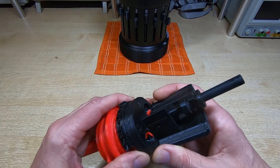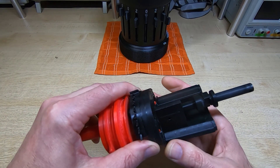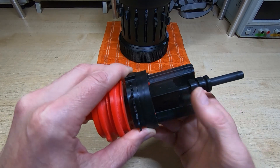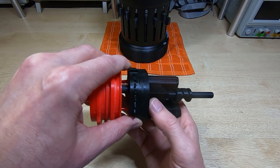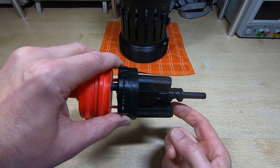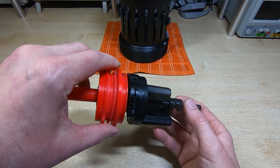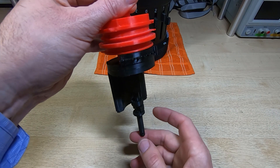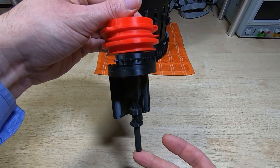The whole sides are kind of tapered so it allows this to slide in. The idea of the spring is it's supposed to positively locate the step drum in one of two locations - a bit like the carry lever springs are supposed to put the carry levers into one of two locations. You have the position where the step drum is lowered - that's the addition mode - and then you have the subtraction mode where we raise the step drum, that's when we pull the crank up. When we pull the crank up, that spring should pull the step drum upwards. But as you can see we're getting this drop down - it should sit right up against the step drum like this, but when I release it you can see it drops down, and that's exactly what we're seeing from the crank.